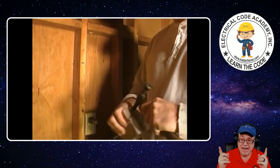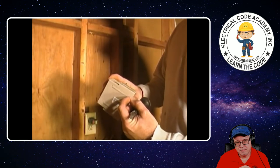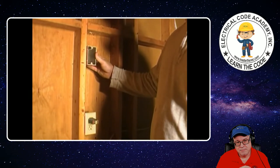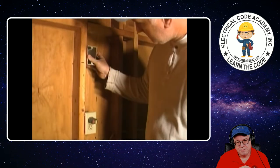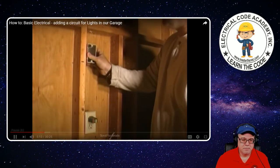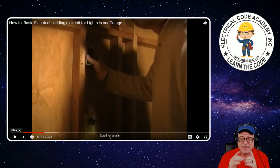Cables, not wires — all have to run cables; you can't run individual wires. These boxes have a little lip that sticks out, approximately a half inch, which allows you to have your box sticking out to make up for your sheetrock or plywood or whatever you're going to put down. Now, remember — many people put the mark at different reference points. When I do receptacles around a room, I do them at 16 inches to the top of the box. Switch locations I typically use 50 inches to the top. Keep it consistent — be consistent so that everything's the same.